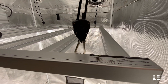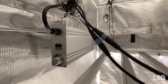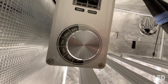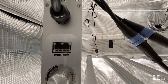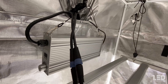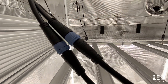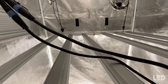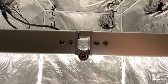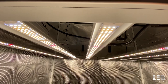The efficacy of 2.6 micromoles per joule is in line with many other lights on the market, including the Growers Choice ROI-E720, Gavita Pro 1700E, HLG 600R Spec, and the Nextlight Mega. While the light output is lower than those lights, keep in mind the fixture only draws 500 watts and 4.33 amps. So if wattage and amperage is a concern, or if you're a beginner grower wanting to shoot for under 1000 PPFD at the canopy level, this light is for you. But if you're looking for a huge punch to your plants, this light is not for you.